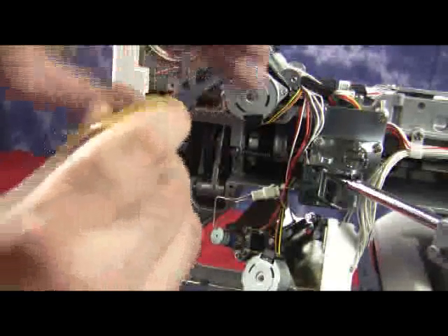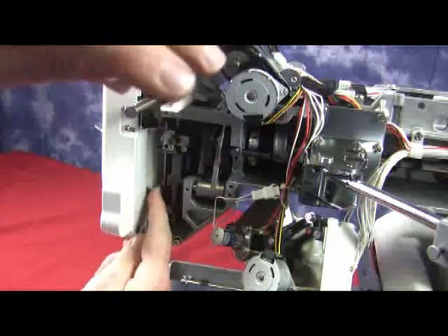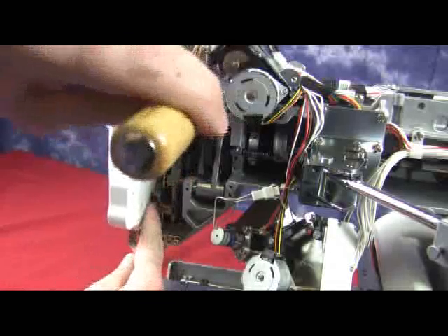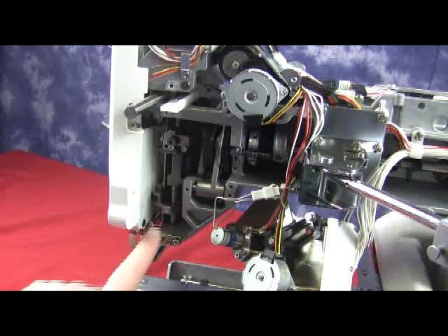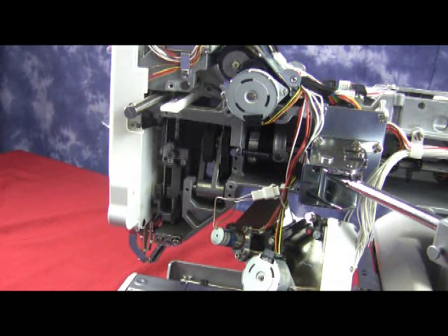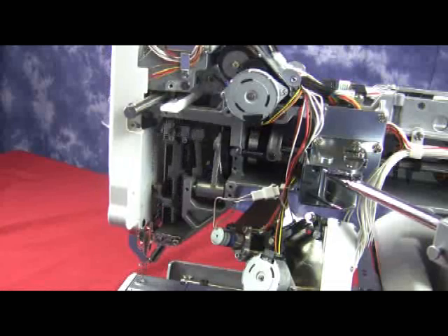Go up to our lateral gear, making sure that the machine is first on 270, and then you can turn the head and back it off. Manually push down the black tab and hold it so you can let it feed into the lower crank. And we're back on needle bar number one. We can see that it's inside the lower crank. Now when we turn the hand wheel, we can see everything is turning nicely and nothing is jamming.